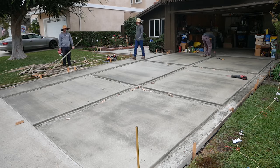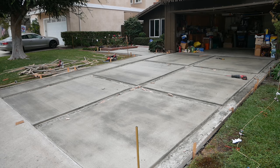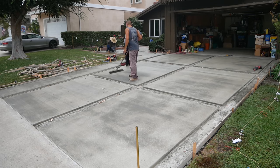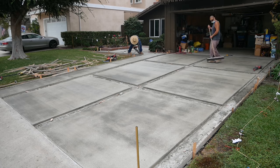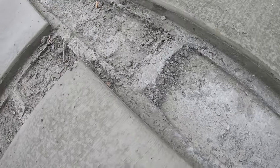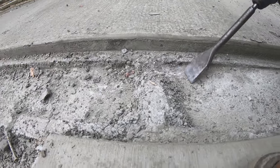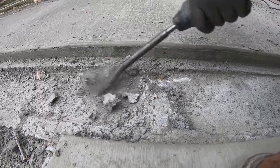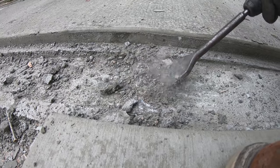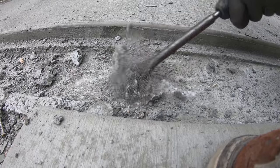All these inlays were set with two-by-two, so it's really just an inch and a half deep on these recesses. It's a monolithic pour — the rebar reinforcement runs all the way through underneath these recesses, so it's all one piece. When you drive over it with a vehicle, everything moves as one piece. You're not going to get grout failure, brick failure, brick separation, or concrete separation from the brick due to movement. It all moves together — that's the beauty of this technique.